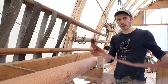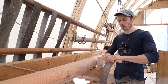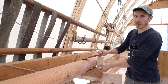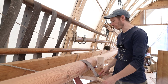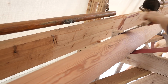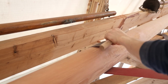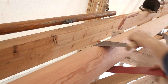So I decided to take the belts apart, and using these two sticks, I can hold each side, and it's not too much work to put them on here and just pull back and forth. It's a little rough on the hands, losing a little bit of skin, but going pretty quickly. At this point, this is 120 grit, and I've done about two-thirds of the mast already. With the really rough spots where there's a lot of ridges and bumps, I'll start with the 80 grit, and then I will jump back up to the 120, and that seems to be working really well.